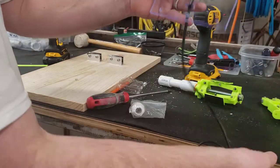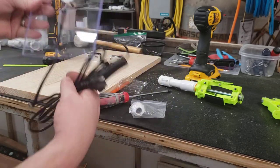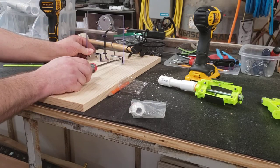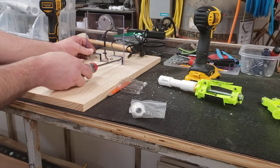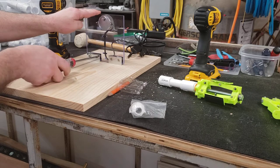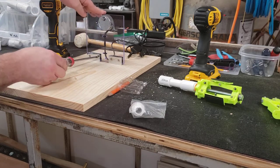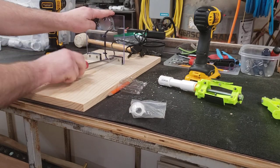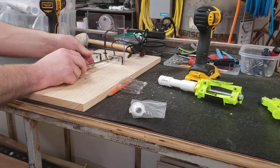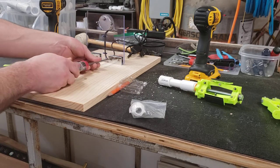Take your plate — you have the motor shaft coming out this side, and that's the back of the motor. You want the shaft facing out towards the way your turner is going to go. Barely snug up all of the set screws, then tighten them down. You don't have to tighten too hard, just enough to keep that plate from moving around. Over time, after hundreds of tumblers, these might come loose — just come in with a screwdriver and tighten them up a little bit.